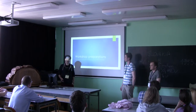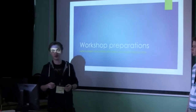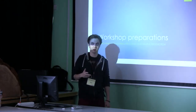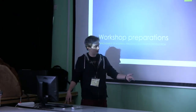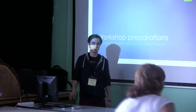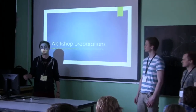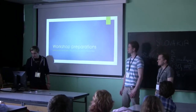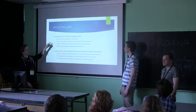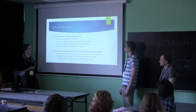The original pieces that we made were a little bit cracked, swollen, and warped. There was also a little bit of discoloration. So what we did was we worked with three wood species and tried to do some product development and improve the program that we used to press the samples. We had some main purposes — key focus points we wanted to concentrate on when improving quality — starting with reducing the cracking inside all of the samples.